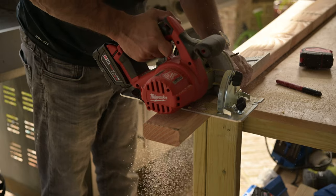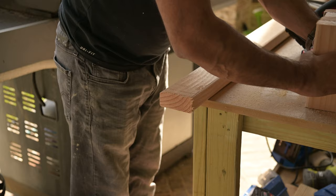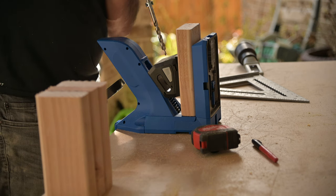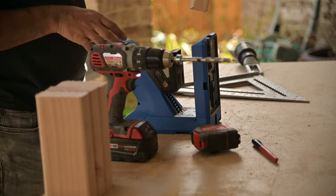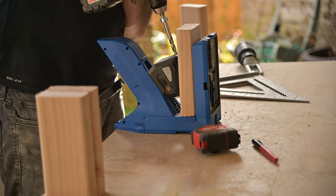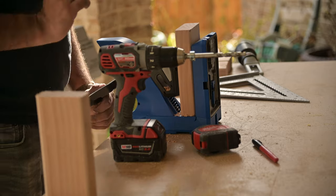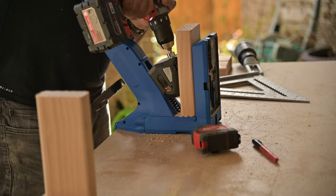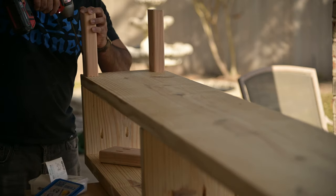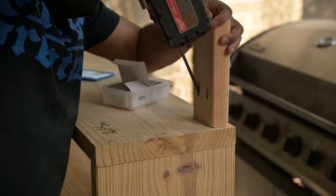For the legs I used four pieces of 2x4. The length of the legs will determine how high off the ground it sits. I needed the legs to be 8 inches long to make sure the console covers all the outlets and cables in the back. I used the same strategy of cutting one first and using it as a reference to cut the rest — a tiny bit of difference in length can cause annoying wobble. I'm joining the legs using pocket holes, so I drilled two pocket holes on each leg. I'll leave Amazon affiliate links for the pocket hole jig and other tools in the description. When joining the legs to the bottom of the console, I oriented the legs so the pocket holes face the back — since the console will be against the wall, no one will see them.